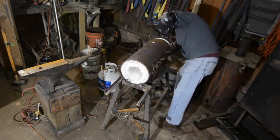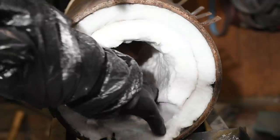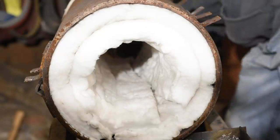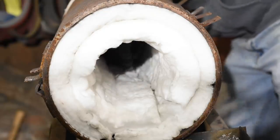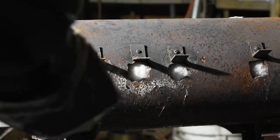You have to be a little more careful about the second layer. You'll notice that I'm putting the seam at the bottom of the forge. The reason for that is I'm going to be covering the bottom with an additional material, so that'll cover up that joint. If you leave the joint exposed, it's real easy for the edges to start fraying and tearing up, and then the inside of your forge degrades faster than it needs to.